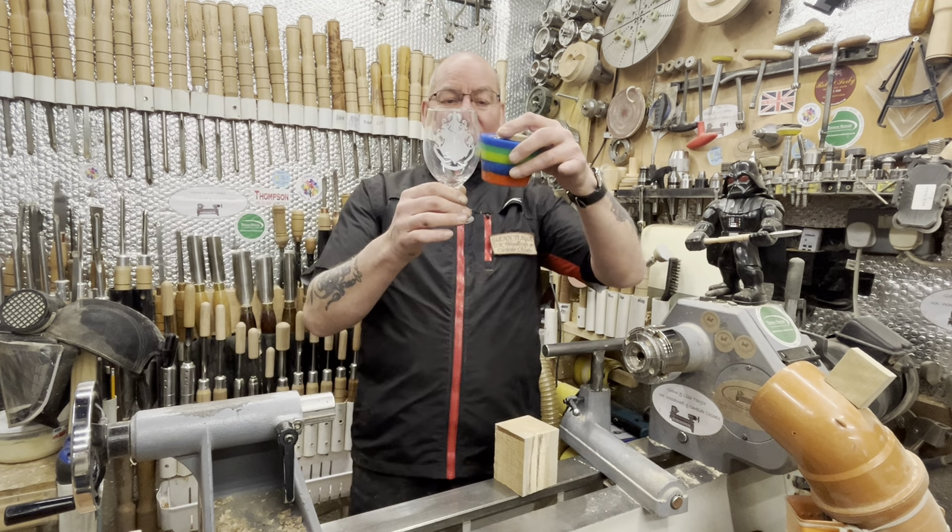It's a very solid piece of kit from RDG — this bit doesn't turn, it's the head that turns inside. My soft touch ones still fit on it — because it's got a chamfer it fits in nicely and centers up well. Really pleased with that. Right now I'm just putting step centers in because I'm turning this down to round. I'll find my center, get it to round, put a tenon on one end and get it ready for gluing up.